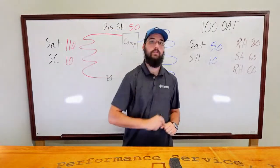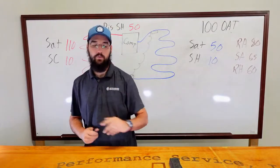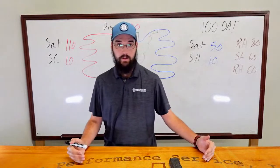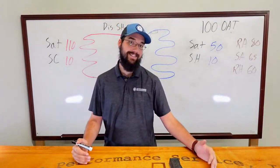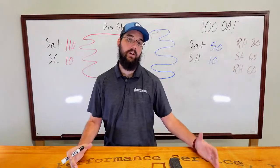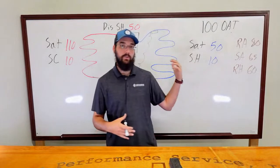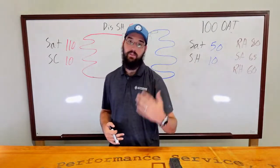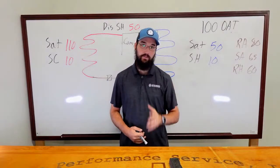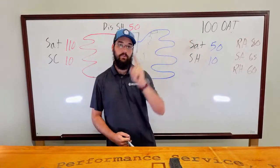Possible. Absolutely possible. You are correct. That's not the problem though, because you go up to the attic and do an inspection of the duct system, and you don't find any leaks, and you don't find anything to indicate a problem with the airstream in the ductwork. So your readings turn into a physical assessment. Your physical assessment proves that theory is false for this specific troubleshoot. But given these conditions, I agree with you.